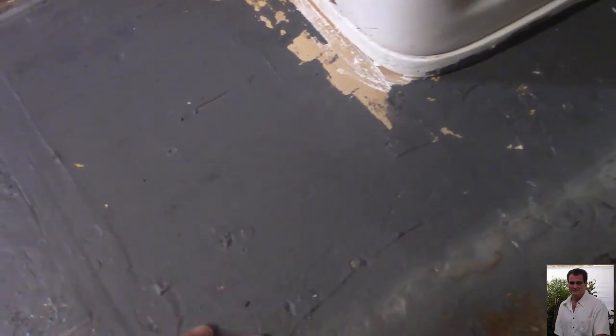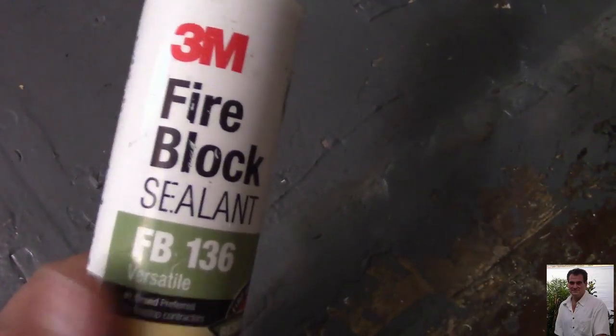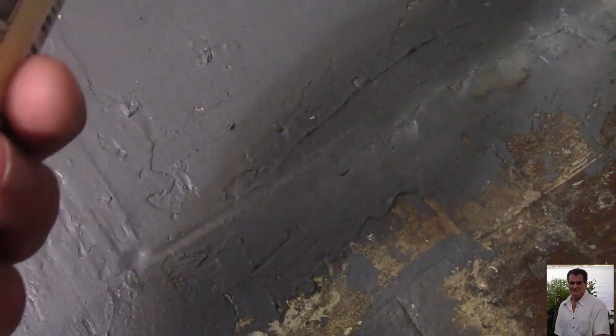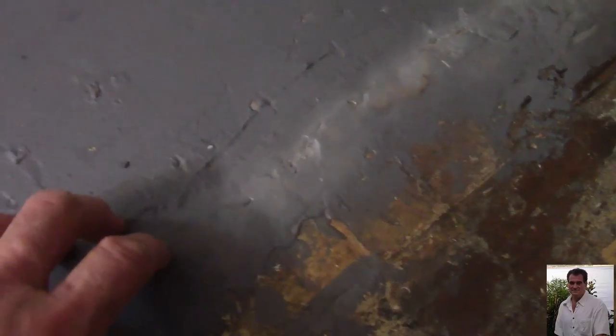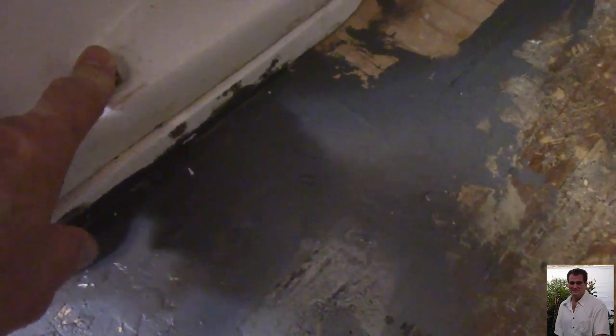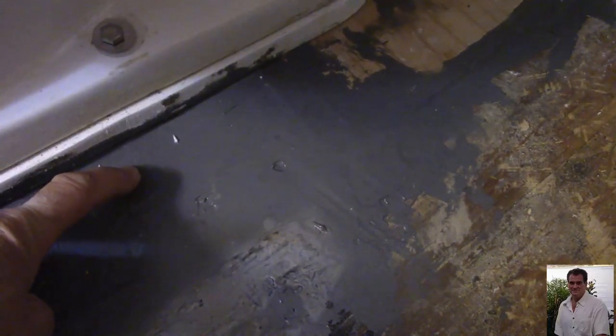It's been a couple of days now. I used some caulk to fill in the holes. There's a caulk you can find at Lowe's called Fire Block — it gets hard as a rock, not like a normal caulk. I put these stainless screws in here with a little plastic washer, then a stainless washer, and then a screw that's about four inches long. The first two inches go through the toilet and that piece of wood, and two inches went down into the flooring.